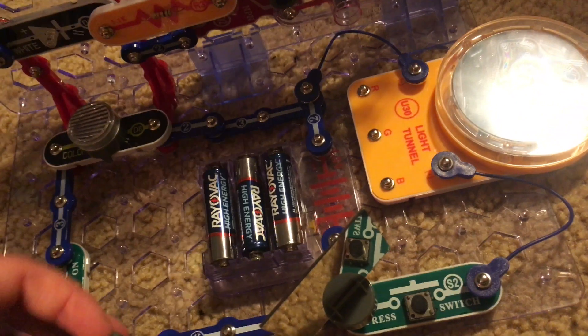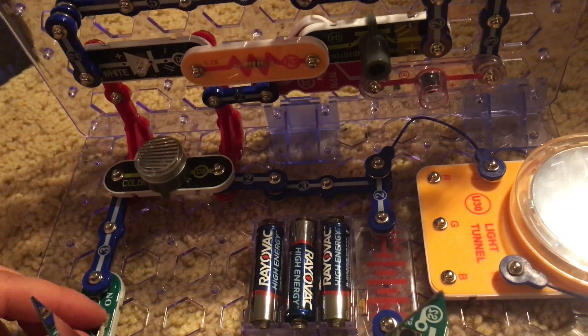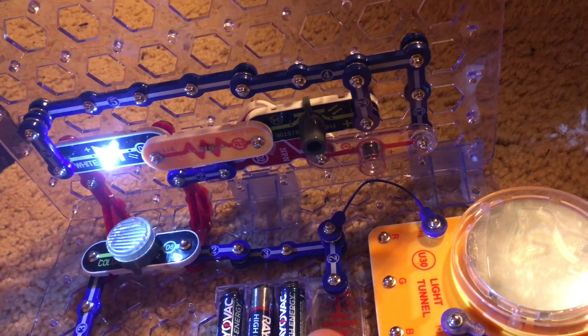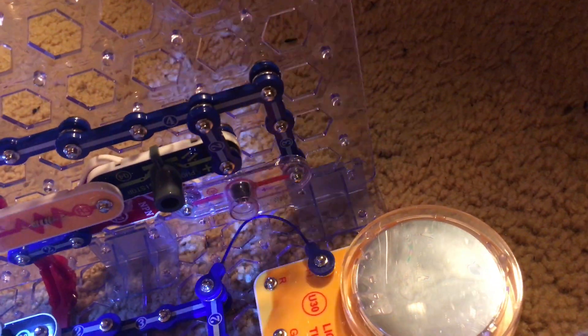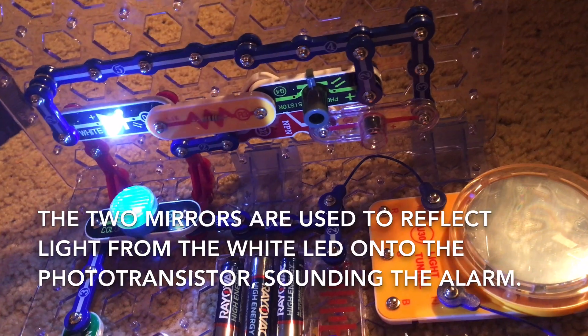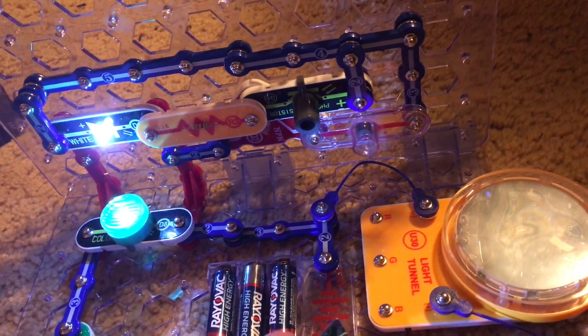The mirrors are not perfect, so they're probably not going to stay on easily. Please turn down your volume — there's a horn in this project. When we turn on the slide switch, the color LED flashes and the white LED turns on. When we align the mirrors properly, light reflects from the white LED across the mirrors and onto the phototransistor. You have to hold the mirrors in a certain position for the horn to sound. The phototransistor is absorbing light from the white LED reflected off the two mirrors.